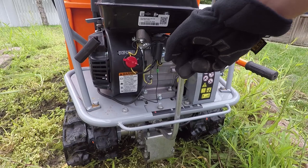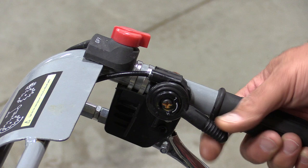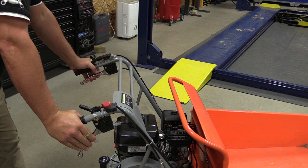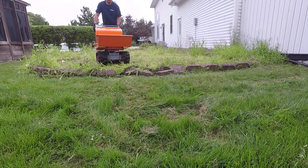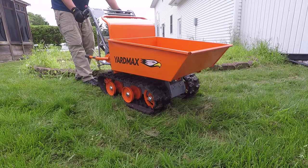When you use it, basically just select a gear and you have a PTO lever on your left hand side. You depress that and the unit will start moving. You can control your speed via the thumb throttle on the right hand side, and you can steer with the brakes on the right or left hand side. It takes a little bit to get used to, and the brakes will also wear in a little bit. In the beginning you might pull the brakes and the track will lock up immediately, but over time you'll be able to feather that brake and really drive this very easily.